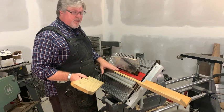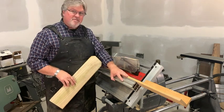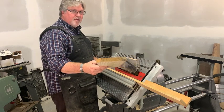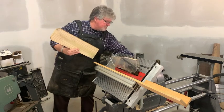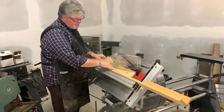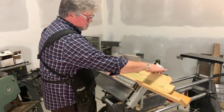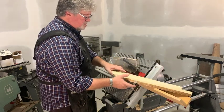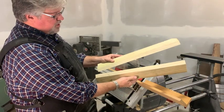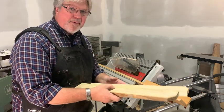As you may have observed, it got a little bit more pinching than I would like. So I added the first step of improvement, and that is an extended fence attached to my main fence. This also has a little bit of a shoulder to help support the stock so that our wood doesn't tip off at the end, and we also have a little bit of a cup here. So we'll be careful with that. Here we go. There you can see the cut that we're getting — they are a match for each other, so they would make a perfect cleat to hold a cabinet to a wall, for example.